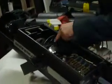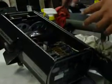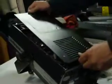So, reinstall the, and of course, I forgot to say, down in the very bottom here, and you're not going to be able to see it on the camera, but underneath here is the fan. You can blow that out with the air hose, but you need to reach up here in the vent if you have small hands, and I can't. Or you need to hold it with a screwdriver, because you don't want the fan over speeding if you blow that out with the air nozzle.